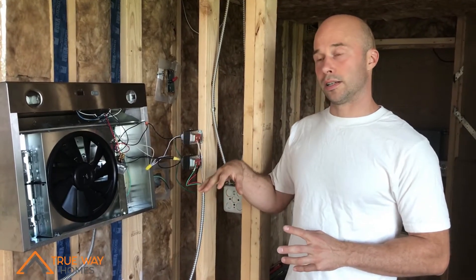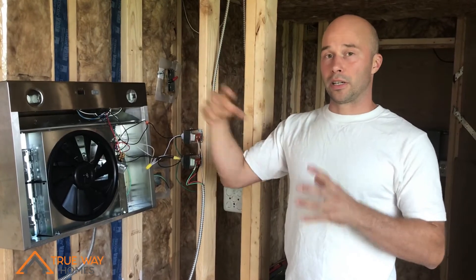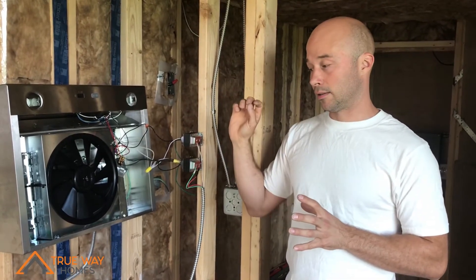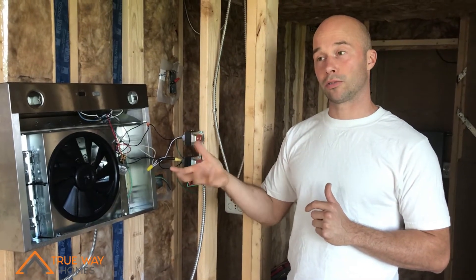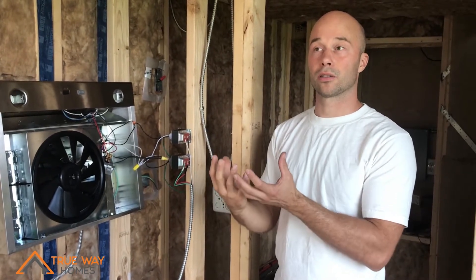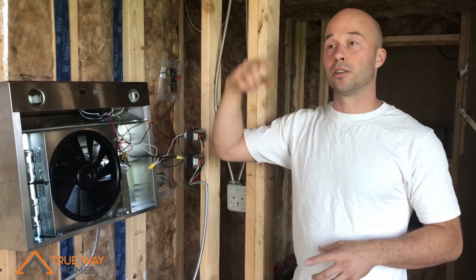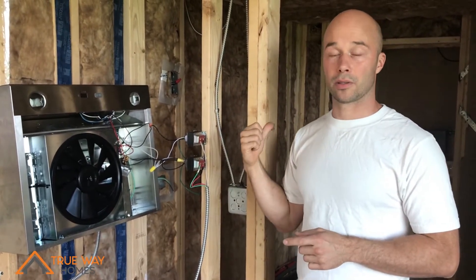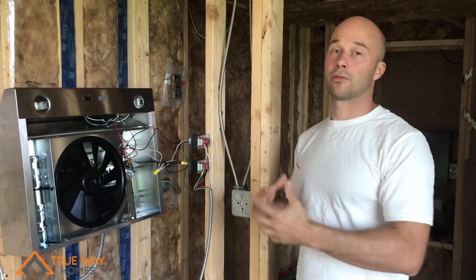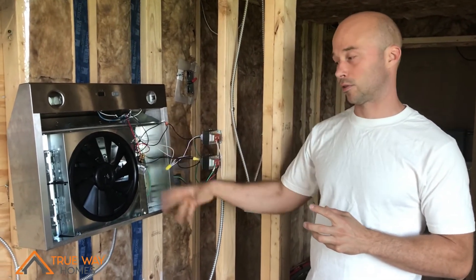The other side of it is the air that you're pulling out of the range hood — you don't want it to be creating a negative pressure in your living space. You don't want to be taking the conditioned air out of your living space. So what you want is a damper that will allow fresh air to come in from the outside and be cycled up through the range hood, creating a closed cycle of air. We have an ERV system — an energy recovery ventilator — that handles the air and changes it over about once an hour, completely replacing all the air to keep it fresh, and we don't want anything competing against that process. So we keep a closed loop.